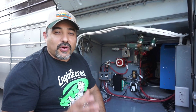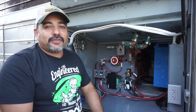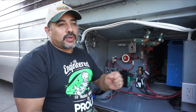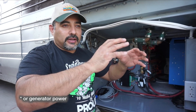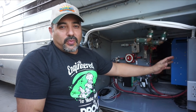The last wire is a little network cable for the Color Control GX — we'll do a whole video on that. As you'll notice, there's no transfer switch of any kind, because with this type of hybrid inverter there's no need for one. It does its own pass-through. When it detects that shore power is live, it will internally perform a transfer and the same AC out will now be running on shore power. If loads get too high, it will turn its inverter back on and start augmenting with battery power.